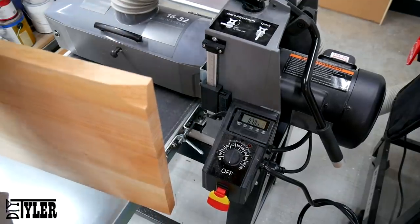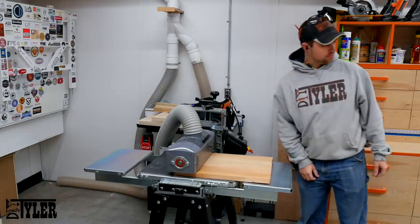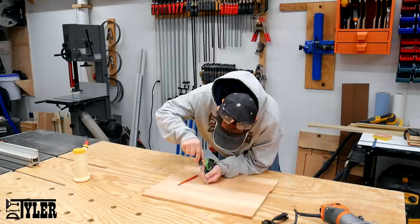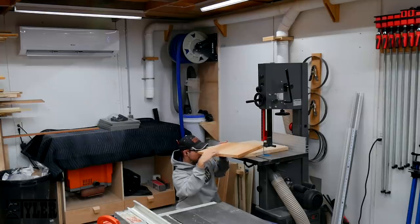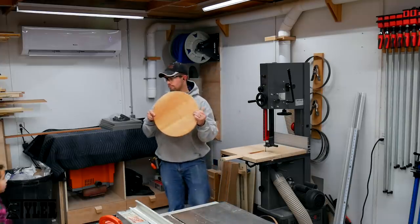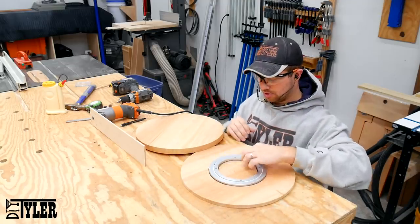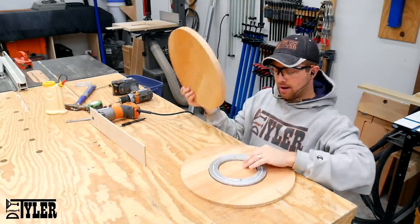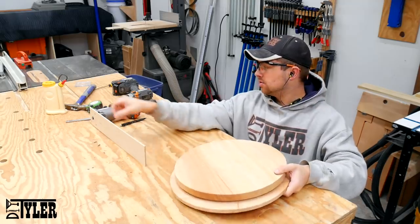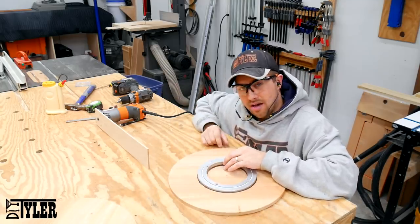This is a new tool in my shop and my goodness, I don't know what I did without a drum sander for so long. I got this because I have a ton of drawers and door faces to make for the new addition on the house. In this particular situation, the two boards that I needed to flatten out are wider than my planer, so I could slide them over to this 16-inch wide drum sander and flatten them right up. After they were flat it was back over to the bandsaw to cut them into circles. This is the bearing I'm using for the rotation — the same heavy-duty bearings I used for the mega rotating shoe rack. I'm going to recess them into the bottom end of the top so that we get about a one-inch gap, and I'm using a quick little circle-cutting jig that I made on the trim router, because my bigger router doesn't have a quarter-inch collet.